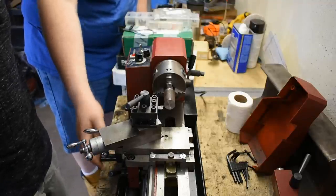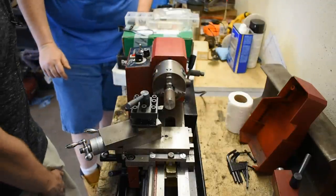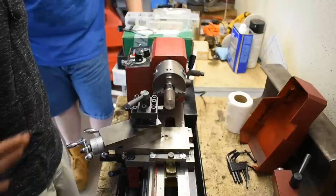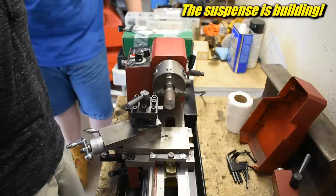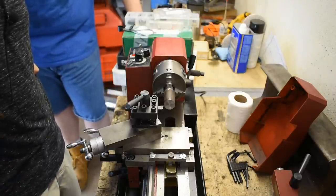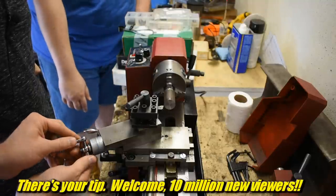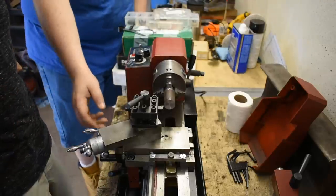Unless you need to feed in a little more. This piece is a little out of round because we were doing something with it in the four-jaw and I didn't have it centered up. By the way, Chirpy showed me this — I didn't see it in any manual, and I've been using this thing for six or eight months. Nowhere does it show you this. You can actually spin this dial so when you're doing very precise cuts you can set it to zero and say 'I want to go in 10 thou.'